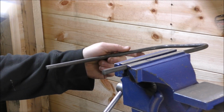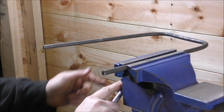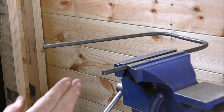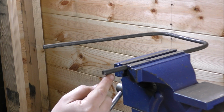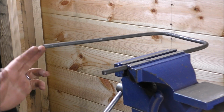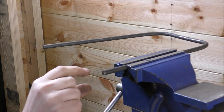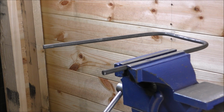It was a great plan. Let's get on with it. So with my eye level, it's a bit like a spirit level, only less accurate. Just making that mostly flat, and then I'm going to grind straight in the end with a grindy slitty disc thing. Make it just wide enough to slide that piece of metal inside there. Same on that side, and then that'll give us a nice little, I don't know, whatever you want to call it, little brackety bit with a bolt hole in it.